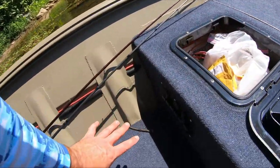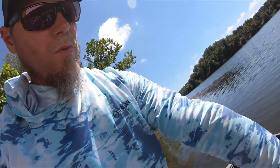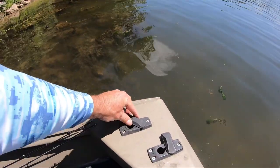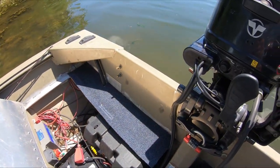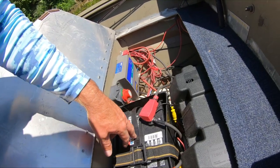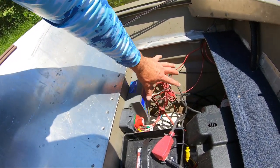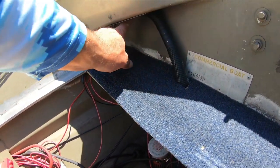Back here I've got a nav port for my Yolo Tech stick — that's hot all the time. Opening the back hatch — For Our Welding welded in this little cross beam deck, it's super sturdy. Inside I've got a two-bank onboard charger charging two Duracell lead-acid 27-series batteries. All power runs to a master switch and fuse right here. I also have a bilge pump with tubing that runs up through the hull and out the side.